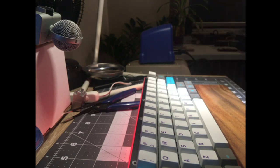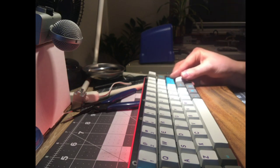Hang on a minute. I forgot my function key. So this is the bold. This is the WinKeyless bold case, evidently. And it has Greetech blacks, which were shake lubed, poorly I might add, with Krytox 3203 from Miller Stephenson. So this is the US stuff from switchmod.net, not the international stuff, which is slightly different but just as good. I don't know what my function key is. I'm going to throw a delete key on it because I'm a savage.